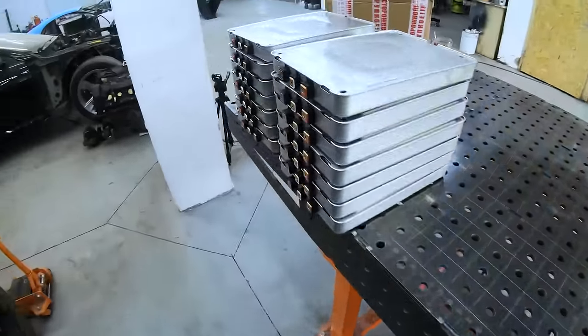The van is moving. We put in more oil to be sure and proceeded with the test. It's running, and we still don't have reverse sorted yet - we got drive first. We suspend the rear axle and run through all gears to pump the whole system, then put the car on the ground with firm intention to drive. But there was another setback: the car randomly starts and drives perfectly smoothly, then stops and doesn't respond to the throttle at all. That's when we came to the conclusion that it would have been better if it hadn't started at all, and we should just proceed to install a manual transmission.